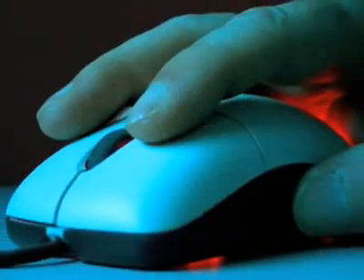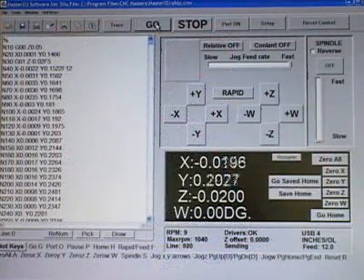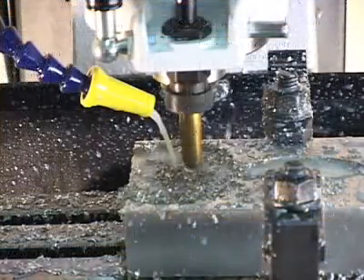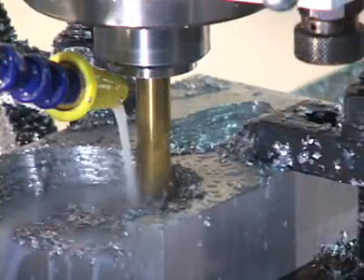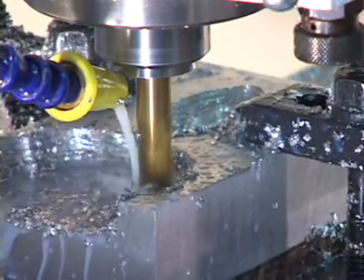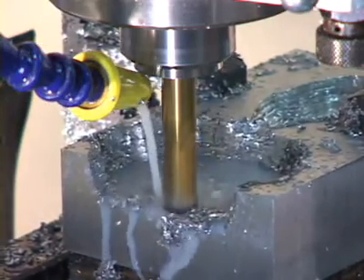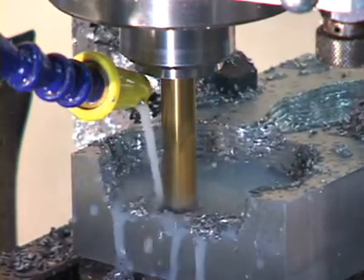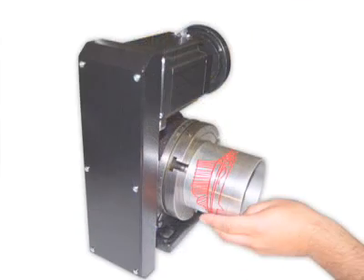You can jog your axes with the touch of your PC mouse, keyboard, or optional handheld remote control. You have feed control, relative control for exact driving distance of each axis, optional coolant control, and optional spindle speed control as well. The CNC Junior is a versatile machine with X and Y precision preloaded ball nuts with anti-backlash ball screws for precise machining of parts, detailed fine engraving with our engraving attachments, and true 4th-axis optional control.